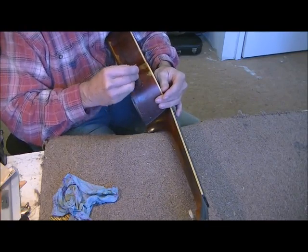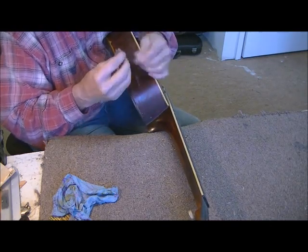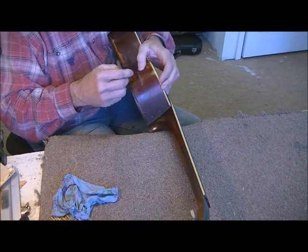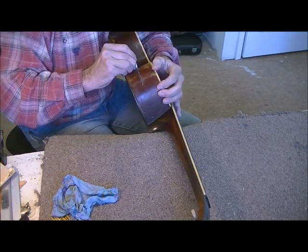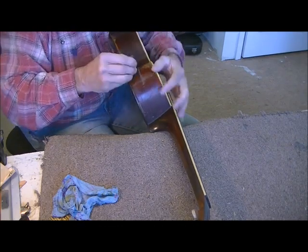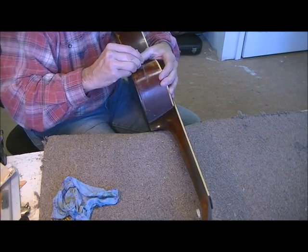The crack is bigger than I thought — it's mostly going to be a fill job because there's already glue in there. I don't like to re-break cracks if they're not broken when I get it, because you can make a bigger mess really fast. Often times the glue will actually be stronger than the surrounding wood, and you'll break the rest of it before you break the glue.